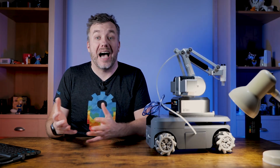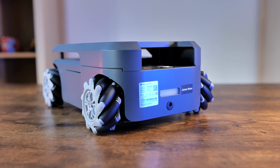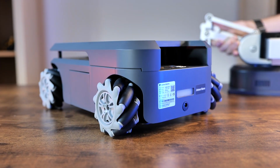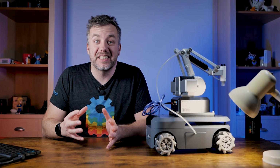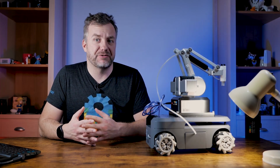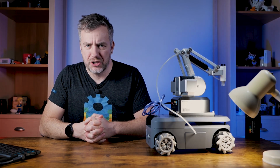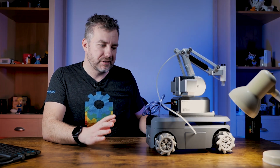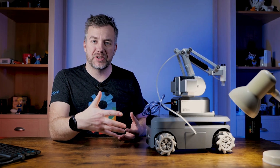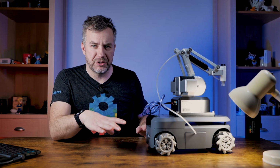I haven't looked inside, but I do have a Jetson Nano version which comes with a 4 GB of RAM and 4-core CPU clocked at 1.43 GHz each. But where the Jetson Nano platform shines is support for the CUDA core, which makes all the vision calculations a little bit faster, and this board comes with 128 CUDA cores to solve all the graphical problems, and I think that is the more efficient version than the Raspberry Pi. So if you're selecting your robot and you want to focus on the autonomous driving, probably Jetson Nano is the version you want to go with.